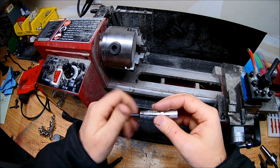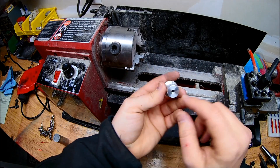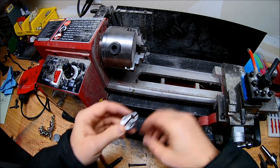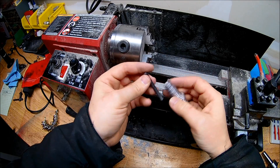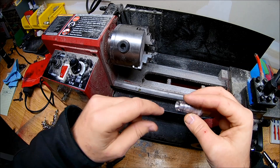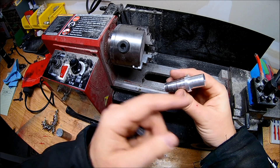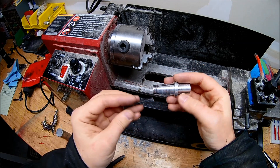I'm going to face the material and make sure it's nice and flat, then I'm going to drill a hole all the way through. There's a small hole here the size of a 1.25 bolt, and then I'm going to drill a bigger hole through the middle that will allow the bolt to rest in there so it's not threaded all the way, which gives some expansion room. Then I'm going to chamfer this end a little bit. I found that coming from the back side to tap it — where the tap ends here — was probably the best bet, just because my tap wasn't long enough to get all the way through.